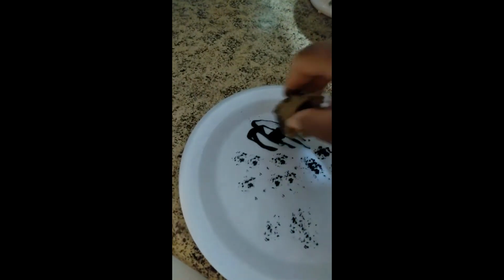Try to do it lighter so that it won't be so dark and look so obvious that you have gone over it. That was not the reason that I went back, but I'm glad I did go back because it's lighter now. The first time it was darker, so you really could see that I had made corrections on the countertop, like this side here, even though it's going to lighten up once I do the polyurethane. So that's all I'm doing, you guys. It's just going back over it, trying to add in those colors that I wanted to add in.